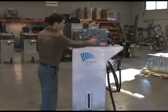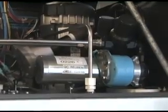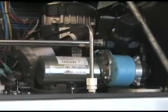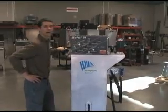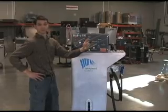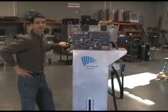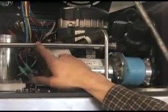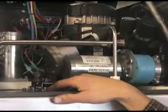Also, the pumps that pump methanol and methoxide mixtures are a unique setup — it's a custom setup that we designed here. It's an explosion-proof motor that remotely drives two diaphragm-style pump heads. The advantage of that is it keeps the liquid methanol, which is flammable, out of contact with the motor. And once again, just in case of fumes, the motor itself is explosion-proof. Any plumbing that's carrying methanol or methoxide, we make out of stainless steel, which ensures its durability and safety.